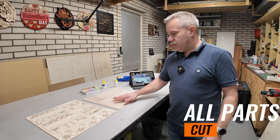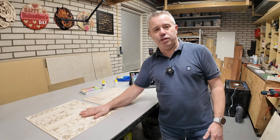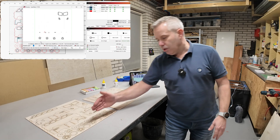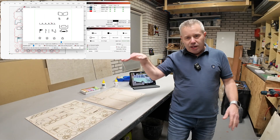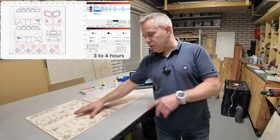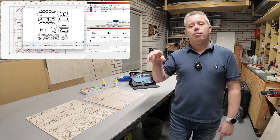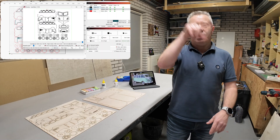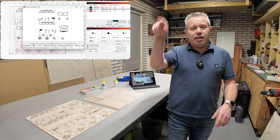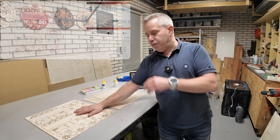So all the cutting is ready. In total it took a little over an hour for both sheets. I did change the settings to offset fill. Regular fill goes line by line — left to right, moving up very slowly — which would have taken 4 to 5 hours for this sheet alone. But by changing it to offset fill, the laser head moves to wherever it needs to engrave — for instance, going around a window and engraving like that. By doing so it went from 4 to 5 hours down to 45 minutes for this sheet.